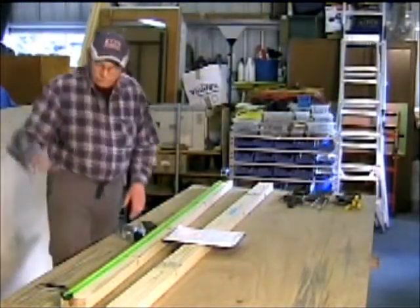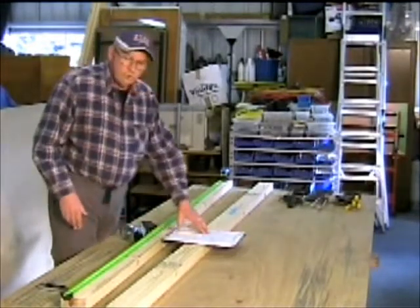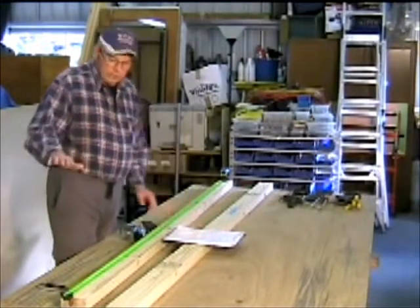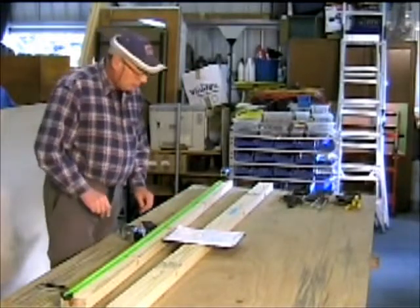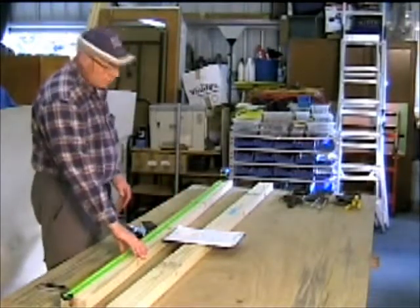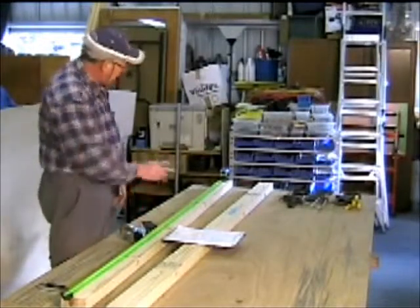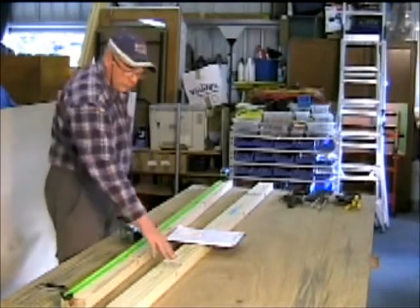the thickness of this, the thickness of the top sheet, all added up is 142. The desired height for the bench I need is 875. So take one from the other, it's 733. So each leg needs to be 733 long, of which I will get 3 legs out of each pair of these, because these are actually 2.4 meters long.